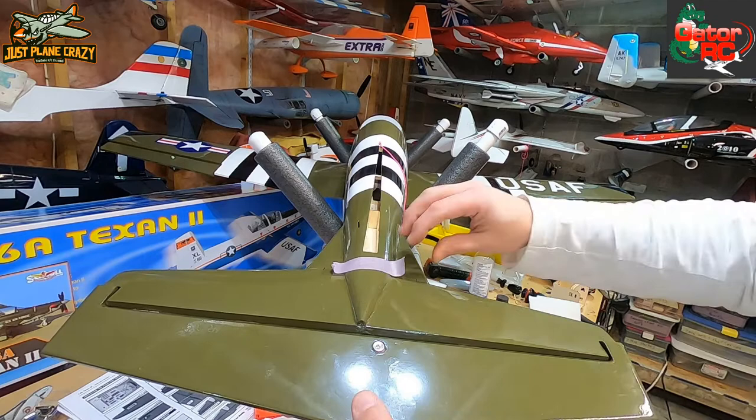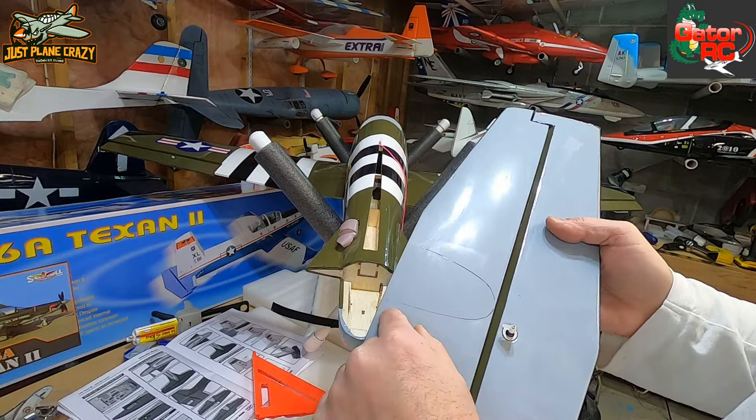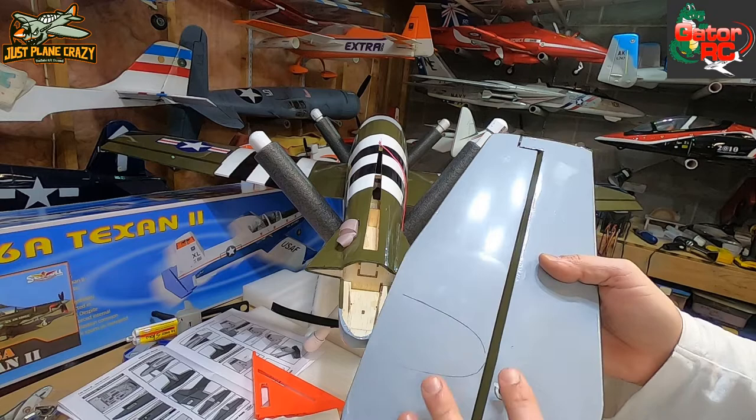So when I take it back off, you can see my witness marks there and there and there. And now we're going to seal this with the iron, which we had already done in prior steps. But I want to cut out just the inside of that. And then I'm going to remove all of that Sharpie marker so it doesn't show through on our epoxy.